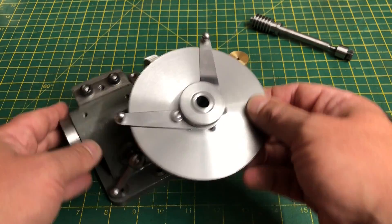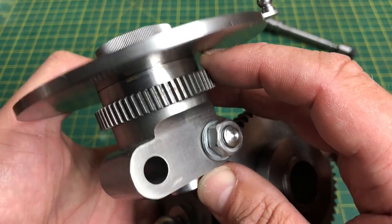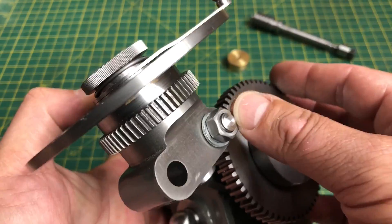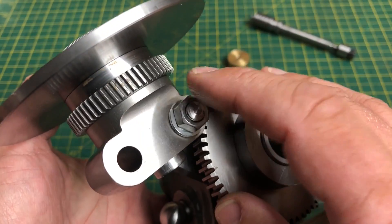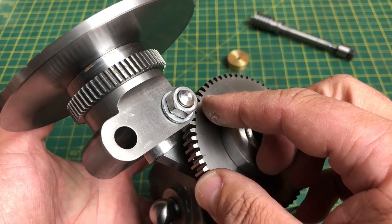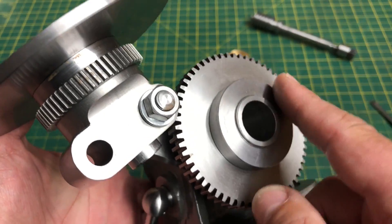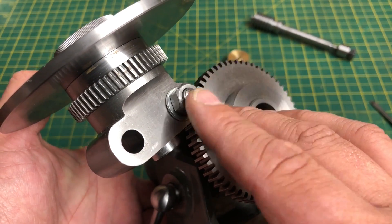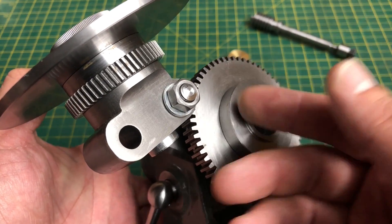As for the project as a whole, I'm not saying that it's dragging on but I am starting to see signs of corrosion on some of the parts - having a project rust before I finish it is a new one on me. All of the parts that you see surface rust on had been covered in layout fluid which I usually clean off with acetone. This is fine but it also removes all of the trace oil that usually protects uncoated steel in my workshop. Luckily this will all buff out with a fine steel wool and I can add a thin layer of machine oil like I should have done in the first place.